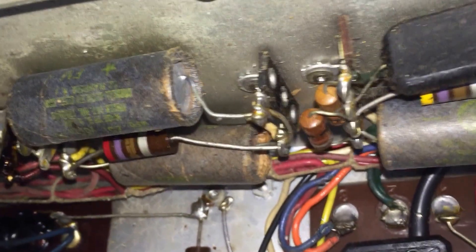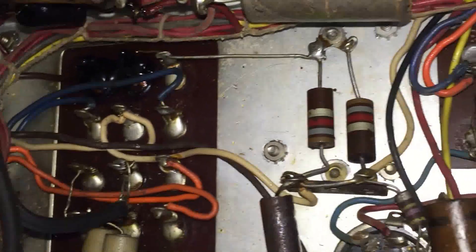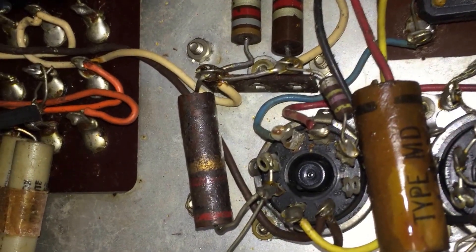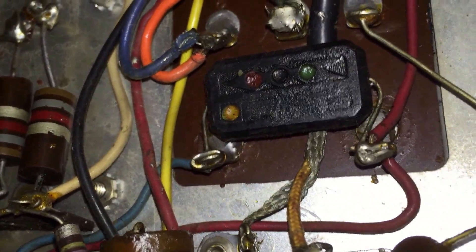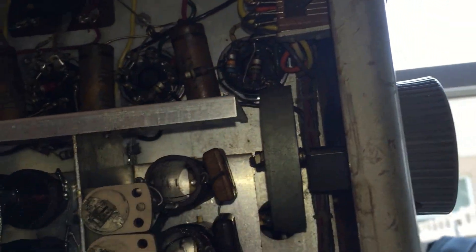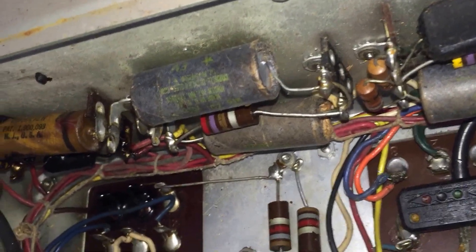They're original, so far as I can tell. Original resistors — I see a very large resistor there. We have some original domino capacitors and various resistors of sorts. The radio is in good condition, but some of these components, and most especially the capacitors, are going to need to be looked at closely, with the most attention pointed to the filter caps.